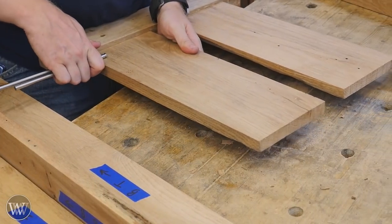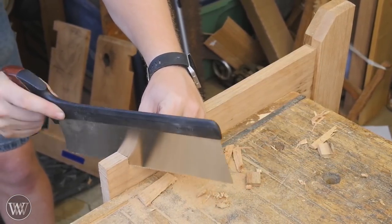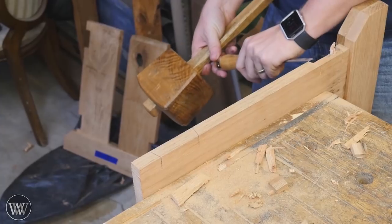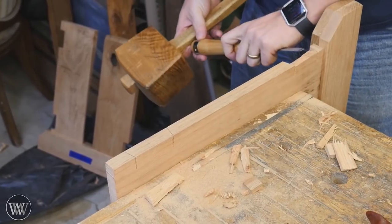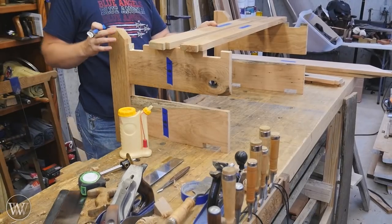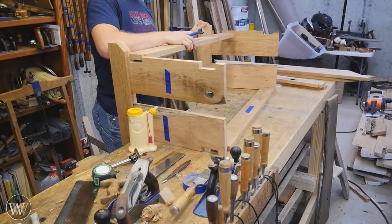Now I need to lay out the depth stop on the legs — where the stretchers intersect with the legs. I do the exact same thing I did before: mark them out, lay the stretcher out, and transfer the marks from the dovetail directly to the leg. Then I cut down either side of the dovetail pin that needs to come out, and after cutting down both sides, I'll come in and chop out the rest with the chisel. I'm staying fairly well away from the line, angling up so I'm not going to blow out the other side. I clean these up completely with the chisel — I don't bring in the router plane for this. It's a really quick, simple process. Now we can glue it all together — if you size them out and mark them well, you should have some really nice, tight-fitting dovetails.